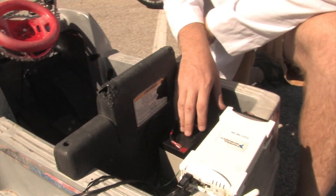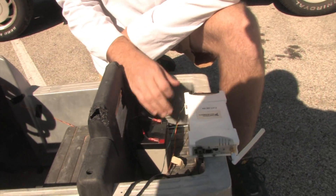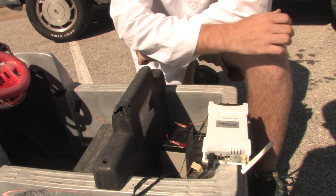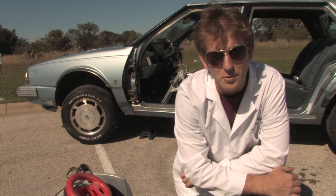All of these sensors require a 12-volt battery supply to power them. This 12-volt battery supply is also powering a wireless DAC, which is broadcasting all of these measurements onto the same 802.11G network as the gaming adapter and the laptop.